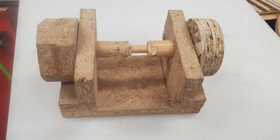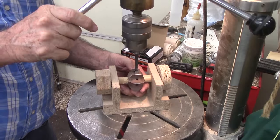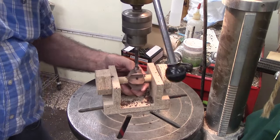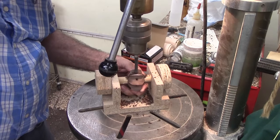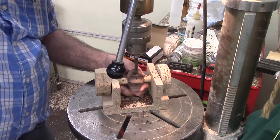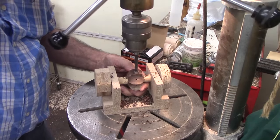The 8 holes were good for the previous turning but now they are too small. I made a jig to support the wood while I drill a 5/8 inch hole to enlarge each of these 8 holes. The jig is a simple support — the center dowel is 3/4 inch to match the center hole. The center dowel is in two parts with a 3/8 inch dowel between them to keep the larger dowel aligned and allow it to split for mounting. I spared no expense since this is made from chipboard.